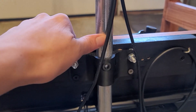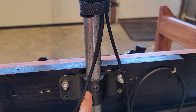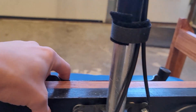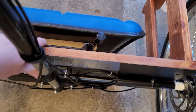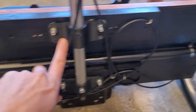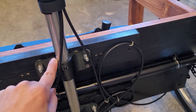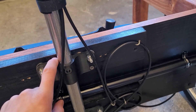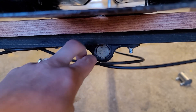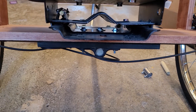You're going to have lift on the shaft so you need a good strong bracket here. I tried using just some metal strapping but that pulled out, so now the bracket is bolted all the way through the metal seat for a strong connection. On other sulkies I've bolted it at the back as well, but drilling a hole through the metal pipe to bolt it creates a weak point that can make the shaft bend. Inside the shaft, running all the way up to the bend, is a dowel rod that increases the strength of the metal pipe.